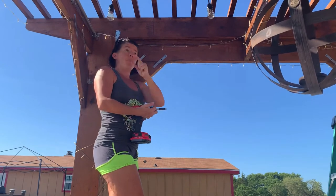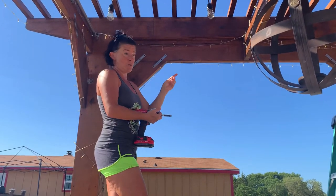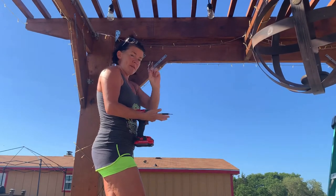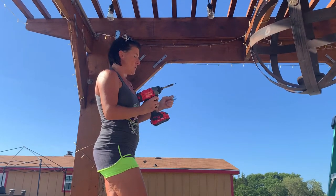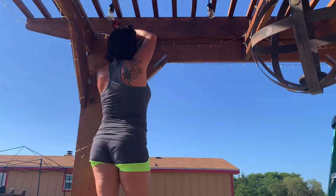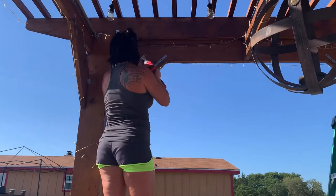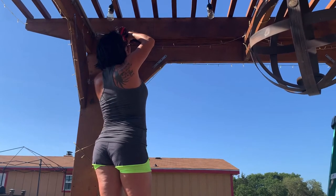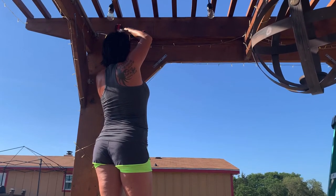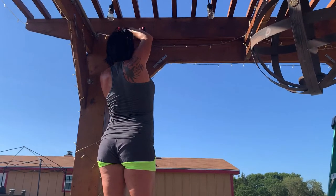So what I'm about to do right now — we've already got the long poles hung and this beam is in the middle of our other long sections, so now we're down to the short sections. I measured those spots for the pipe, got them cut, and now these little conduit brackets go around the pipe. I've already got a place marked where I want my rod to hang and I'm going to get those attached. I'm using inch-and-a-quarter screws so that they don't go through the outside of my two-by framing.